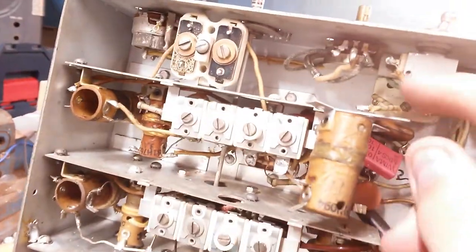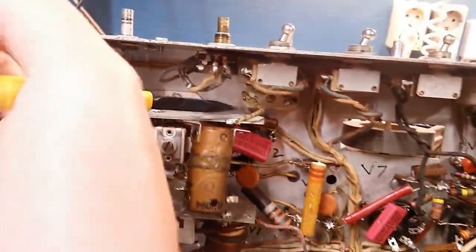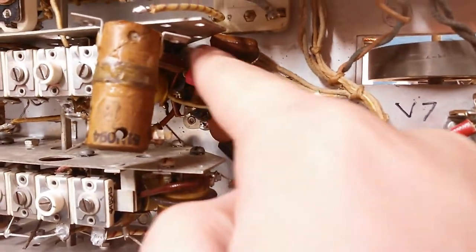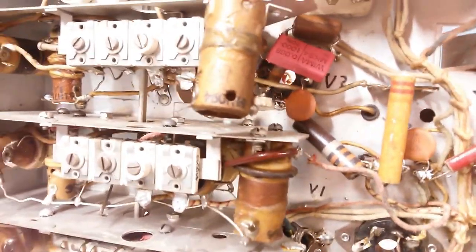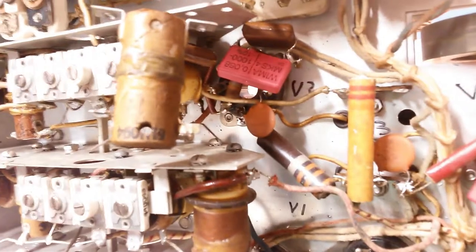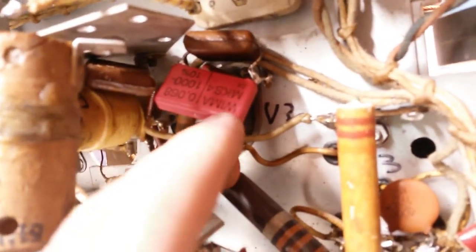This was a pain — I've been fighting with this for at least an hour. I ended up unmounting this coil and unsoldering it. Since the screws are inside I used my pliers to unscrew them, and that gave me just enough access. You hook this onto this and just solder it like that — that has to be good enough. I can't do any better than that. I had to do that with my left hand so it was almost impossible, but I got it. I hope that solder joint holds up.